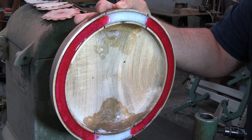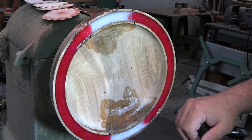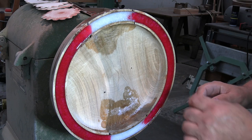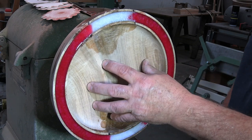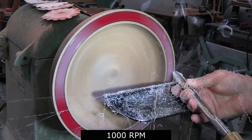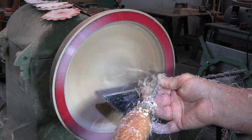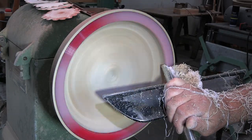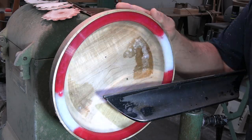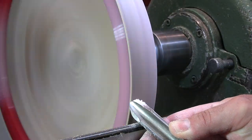All right, so it is the next day. As you can see, we've had a little bit of bleeding over — it's just kind of the style I was going for and I fully expected this was going to happen. What we're going to do now is expose the sides, and then we'll get our maple leaf carved out and get that filled with some resin. There may be some of you wondering why I didn't pour the red maple leaf the same day — I could have, but I wasn't really crunched for time, so I figured I would let the rim cure up and then go back and do the maple leaf afterwards. That way, if there's any filling that needed to be done, it could be done at that point as well.